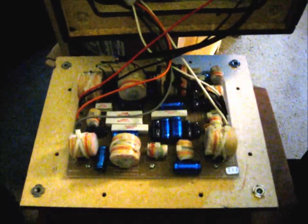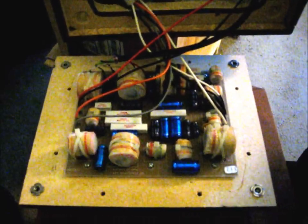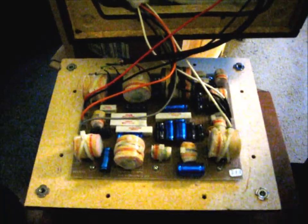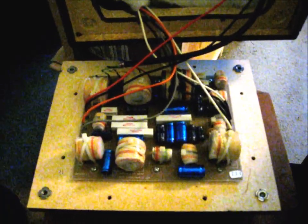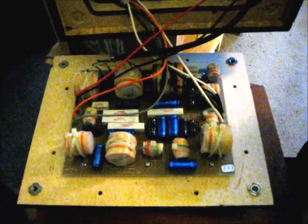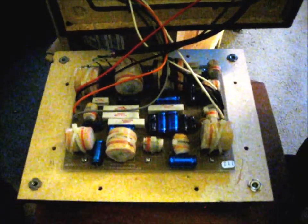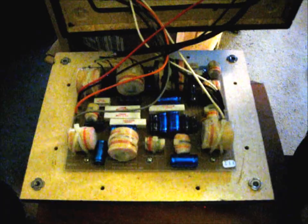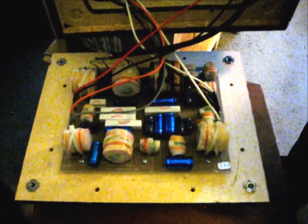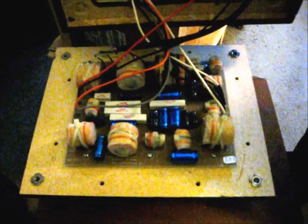You've got about 16 electrolytic caps here. This speaker is old enough that all these caps need to be replaced, though it's not absolutely necessary at this point. These are high-quality caps, and even though they're electrolytics, most of them are probably still going to be within tolerance. If you do decide to replace them, replace them with high-quality electrolytics.